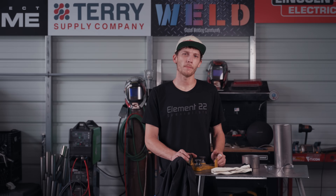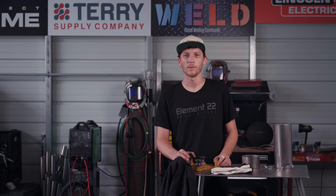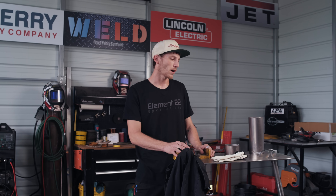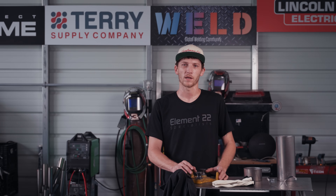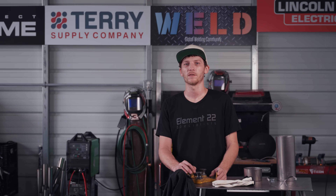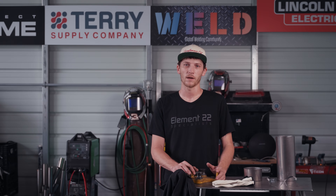Today we're going to be making a titanium weld on this four-inch tubing. I want to elaborate on the safety of working with titanium — obviously safety glasses, gloves, and long sleeves always when welding, cutting, and grinding. When you're welding titanium it's not flammable, but cutting it, drilling it, grinding it — all that dust, the chippings from the saw — all that stuff is very flammable. I cannot exaggerate that enough. Always clean up when you're done cutting and grinding and get that out of the shop area.